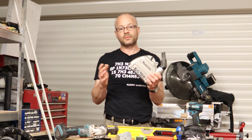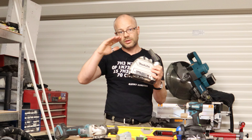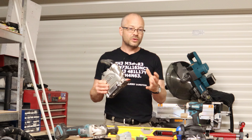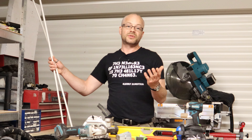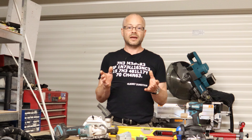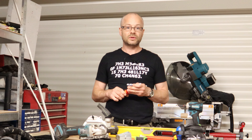I'm also going to be using my attachment which fits onto my angle grinder — this will collect most of the dust, which is great. It's also spring loaded which means I can plunge the blade into the wall, catching a lot of the debris, and I can actually see where I'm going with the screen, which makes life easier. I've also got oval trunking: 20mm trunking for the twin-and-earth cable for power, and 16mm trunking for the data cable for the phone line. On top of that I've also got a pair of blunt-nosed snips or pliers which will come into use very shortly.